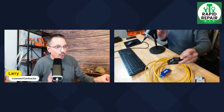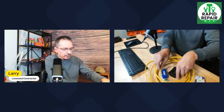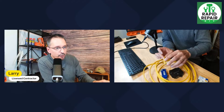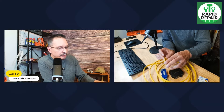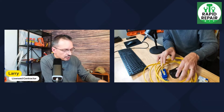You are installing a standard 15 amp receptacle outlet — the most common one you see everywhere in home improvement stores. You're on a 20 amp circuit, which uses yellow Romex wire. 20 amp circuits use 12 gauge wiring, which is thicker than 14 gauge. 12 gauge wiring and 20 amp circuits are found in your kitchen receptacles, dining room receptacles, and anywhere with a higher power draw.